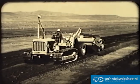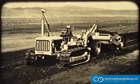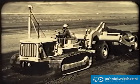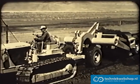Work on the farm is also a natural for these scrapers. On land leveling, pond building, and erosion control, the low-pressure tires float the scraper over the areas to be leveled. Accurate control of the cutting edge permits biting deep or skimming the surface to bring the land to water-level smoothness.